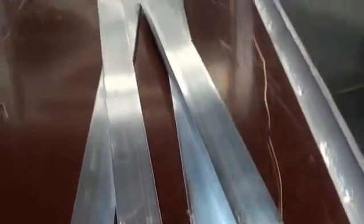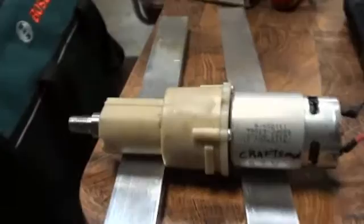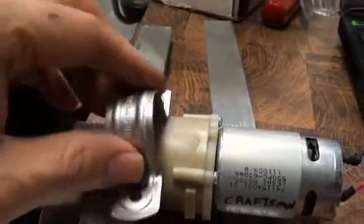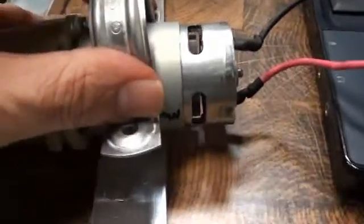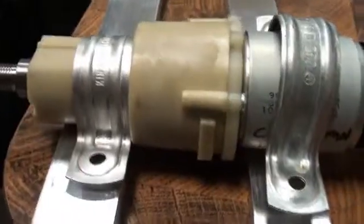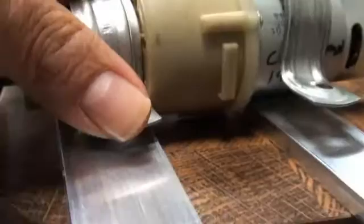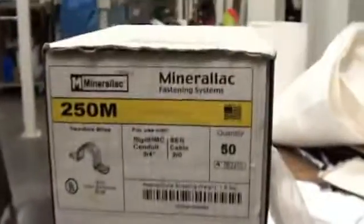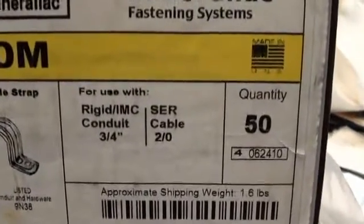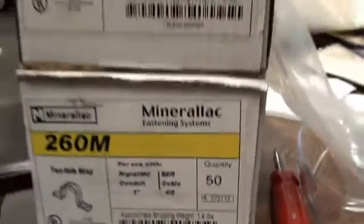Here are our frame rails — two sets, one thick, one thin. The cheapest and easiest way to clamp these is with pipe clamps. These stretch just ever so slightly going over the motor and the nose piece, and you can see there's a gap, so when you put some screws through there it actually pulls those down into tension. These are the pipe clamps that work: a three-quarter inch for rigid conduit and a one inch also for rigid. This base plate is 12 by 12.